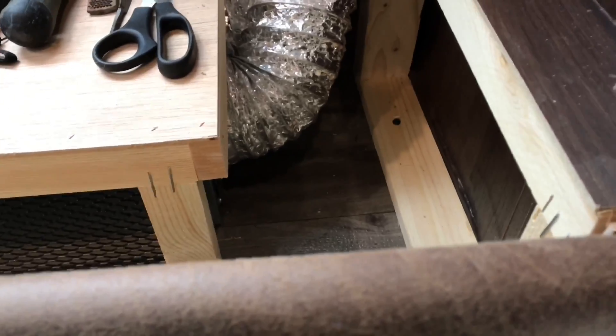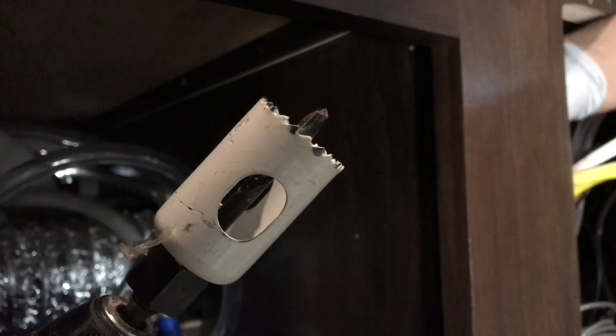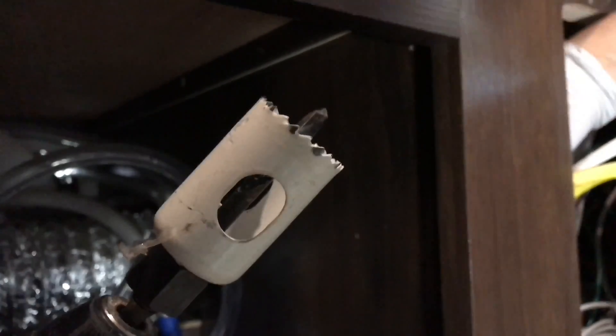Fully connected. Now it's time to run this wire through this cabinet right here, all the way where I need it to be on this side. There's one screw right there — take it off, and what's behind there is your water pump. What I'm going to do is run it from the top right here, drill a hole just right here, staple it to the top, and run it through. Drill another hole to punch through the other side — right there. I've got no cables on the other side that I will cut into.